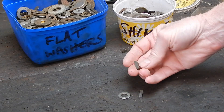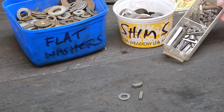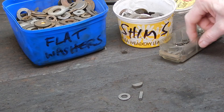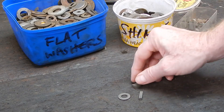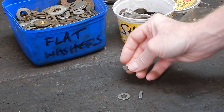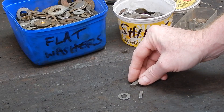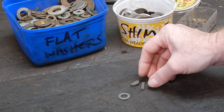You want to get a woodruff key that's the right width. I keep all my old woodruff keys — I've got stacks of them — and quite often you have to get one reduced to make it fit. It might be too wide, or you have to make up your own woodruff key, which you can do. It's not that difficult. They come in all shapes and sizes.